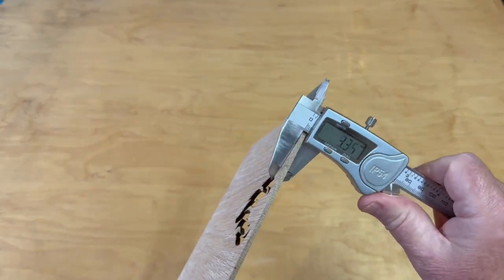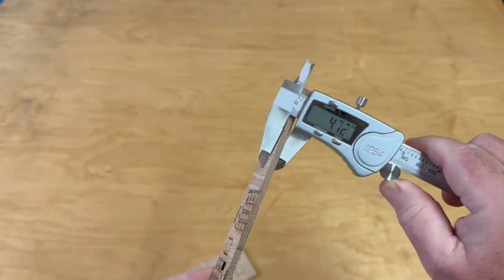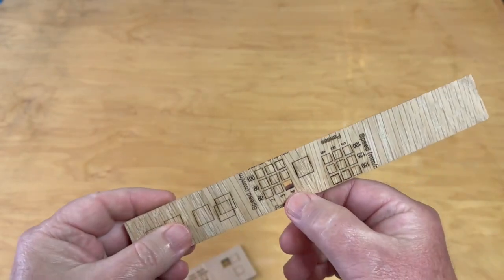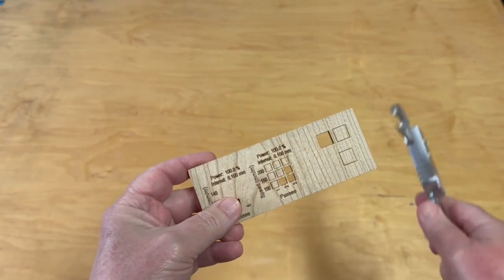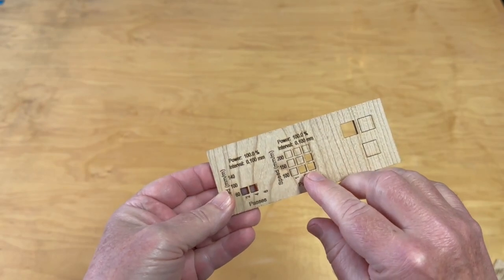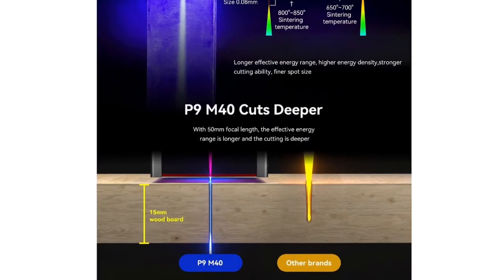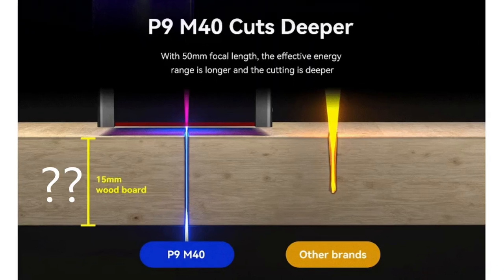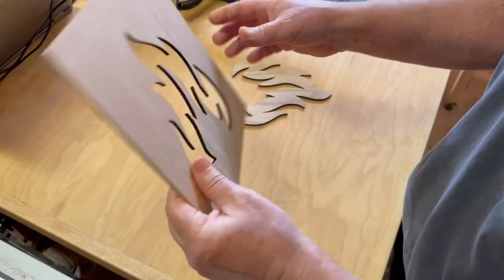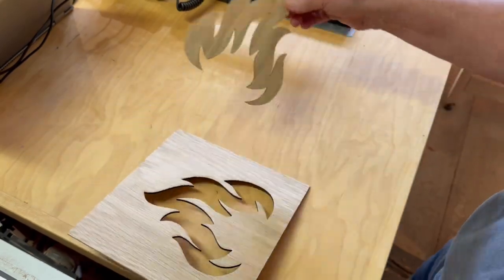Just a couple of notes on cutting solid hardwood with this laser. I was cutting 3.3mm white oak, and I also tried thicker oak at 4.5mm — with four passes and a really slow speed I was able to cut through it, but it wouldn't likely cut any thicker oak than that. I tried 3.5mm cherry and it cut through with two passes, so it's quite a bit easier than white oak. While the advertising may say this laser cuts 15mm wood, maybe for lighter density woods, but for dense hardwoods I'd say three to four millimeters is the limit — which is still pretty good for only a five-watt laser. Many five-watt lasers claim only to cut light-density wood and not dense hardwood of any thickness.